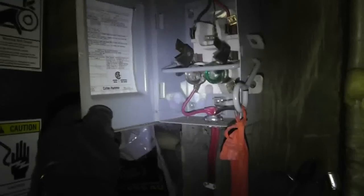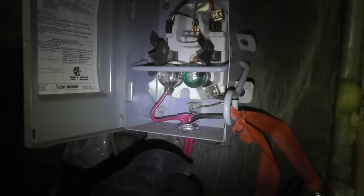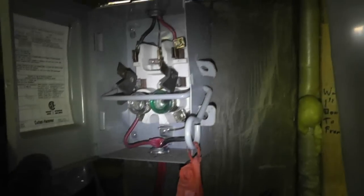What I use to turn my compressor off is this power box here. I think it was meant to be a simple power box for a job site or something like that — it's just two blades that make contact, and there are also two fuses in here, but these never blow. One of these will last a very long time; you can lock it off if you don't want somebody to turn your compressor on. You're not going to have the same problem you would with a breaker, and it's pretty simple to wire in — just hot in, out to the compressor.